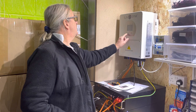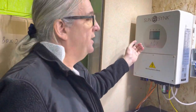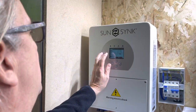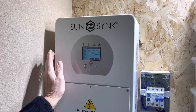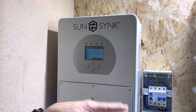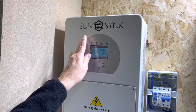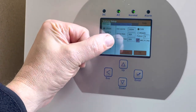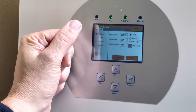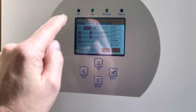Let's look at some of the settings because they're quite important. We press the cog in the corner, go into settings, then go to battery. It shows lithium CAN zero — so lithium CAN is working. We've got no solar on here, so there's no solar LED and no fault condition. AC is on, normal conditions. We've set the battery capacity, the maximum charge, and the maximum discharge.